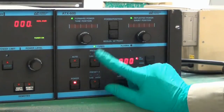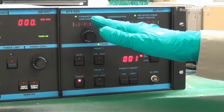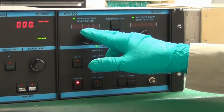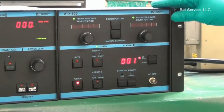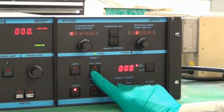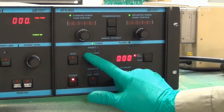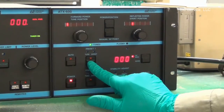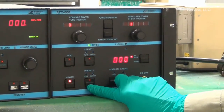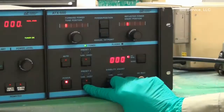The tuner can be positioned with two capacitors — one for the tune, which is inside this automatic network, and another one is a shunt one. The shunt capacitor is parallel to the input power and the tune one is in series. There are preset one and preset two positions, where you can adjust the tune capacitance position and the shunt capacitor position. When auto is not selected, by pushing this momentary button it indicates the tune and shunt positions on the display.